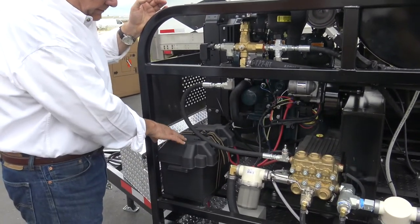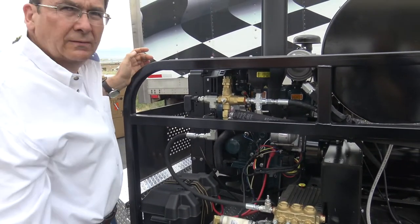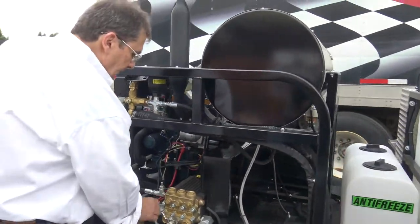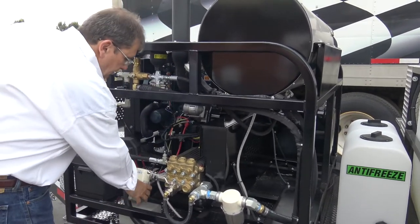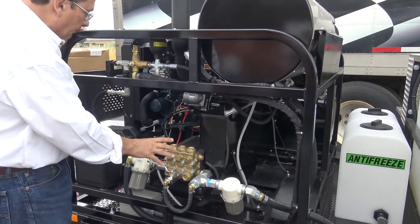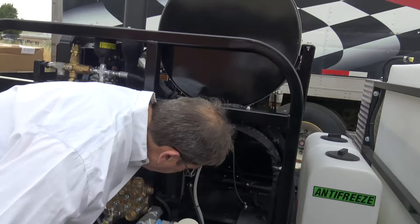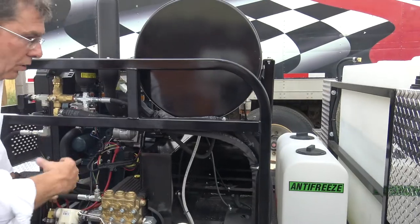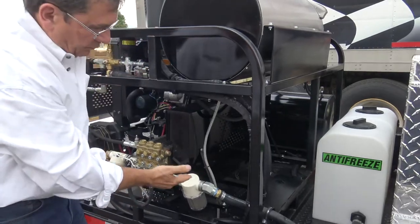We use a deep cycle battery, the best battery you can get. I think it's a 24, group 24. Brain's working today, even before coffee. Okay, pulsator valve, on position, off position. The filter's feeding the pump. Now this is dual fed on this pump, so we're getting really super performance. I like to check the belt tension up here inside before operation. Boy, they feel good. I just like doing a walk around before we start. These filters have got to be tight, or this will want to suck air.